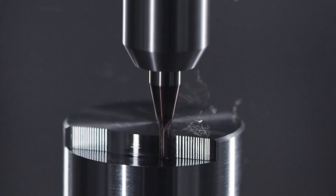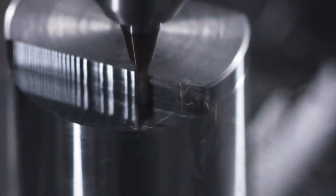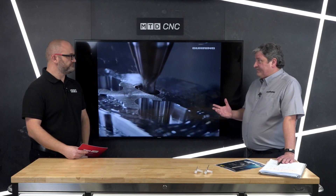The Diver has been very successful, and this new product follows a similar ethos — multifunctional, drill, ramp. The geometry is very similar; it is a three-flute cutter. On the end geometry, the cutting edges are actually to the center of the tool. Historically with slot drills one tooth was always over center, but here you've got equal length cutting edges, so the swarf is actually of equal length and shorter.